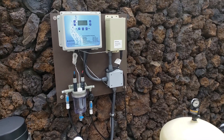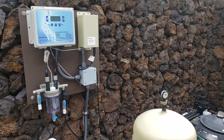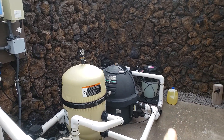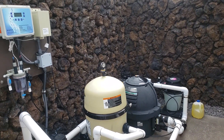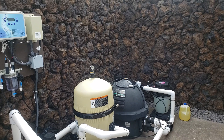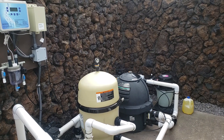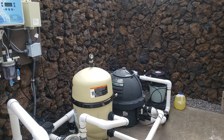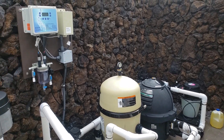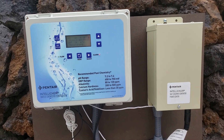Hey guys, this is a training video for our crew here at Pool Bright, and this is going to be required reading, so to speak. So this is the problem: everything checks out here, but we are not getting acid dispensed into the pool on a regular basis, and the homeowner is receiving text messages and email updates saying that the pH is rising in the pool. At some point if the pH rises too much, it's going to lock out the ORP or the salt cell. So this is what you want to do — go through the process to see if, by chance, the wall-mounted controller has reset itself during a power outage, which is entirely possible.